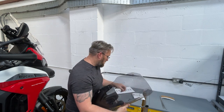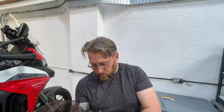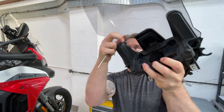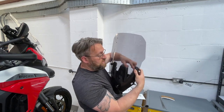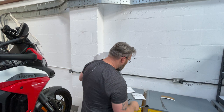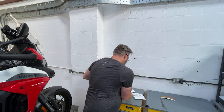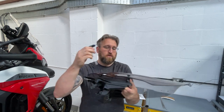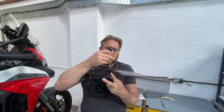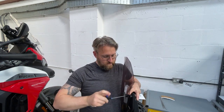One point I forgot to mention: what you need to do with the upper screws is put the nut into the rebate in the rear of the spacer. There's a little hexagonal rebate which is for the nut, and it will stop the nut rotating when you put the screw in. The easiest thing to do is put the screw with a countersunk washer through the hole with your finger behind the spacer — you'll feel when the screw bites hold of the nut, and then you can just drive it all the way home.